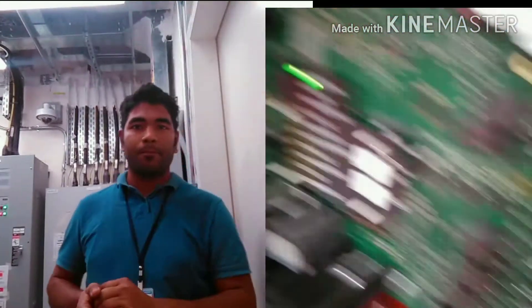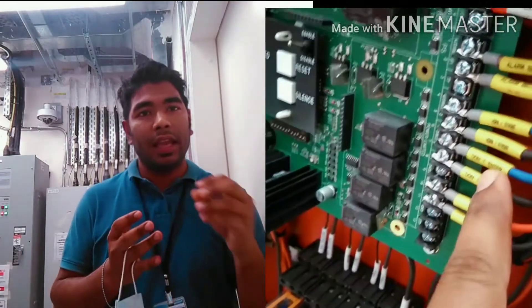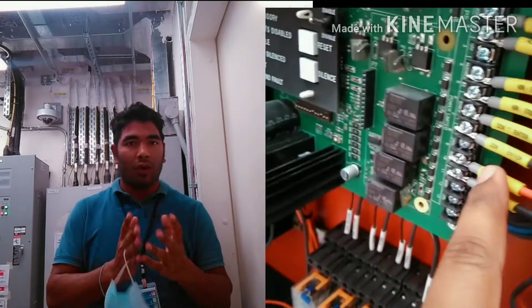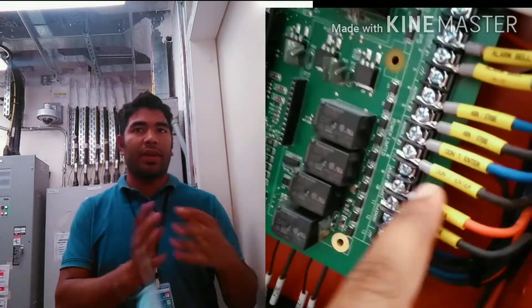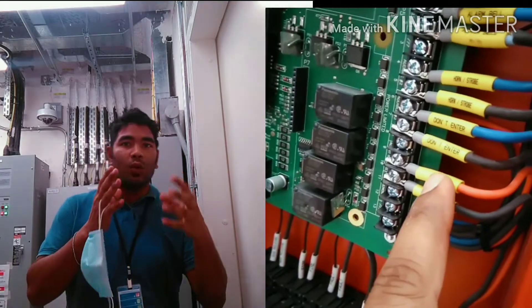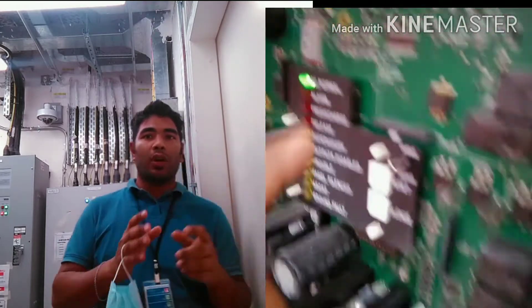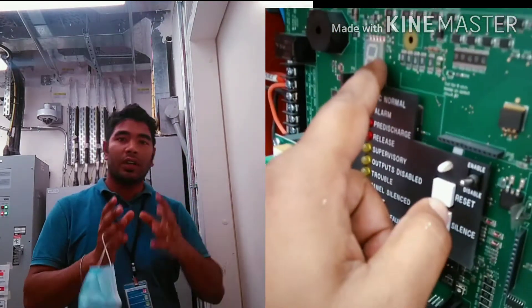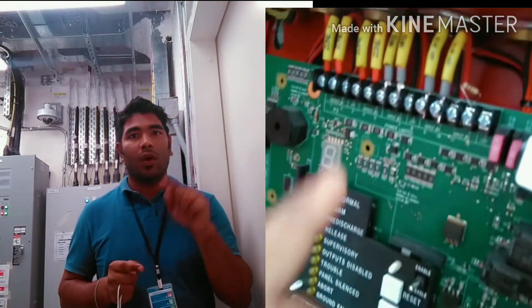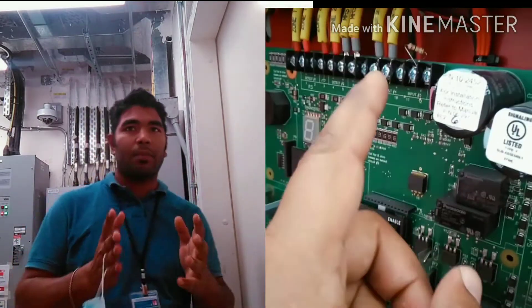Step three: fault condition. Number one: if any of the devices appears at fault, including AC and battery failure, an internal buzzer will sound, the fault LED will light, and the fault will be displayed on the panel. Identify the fault cause. Number two: press the silent button on the panel board and clear the fault condition.